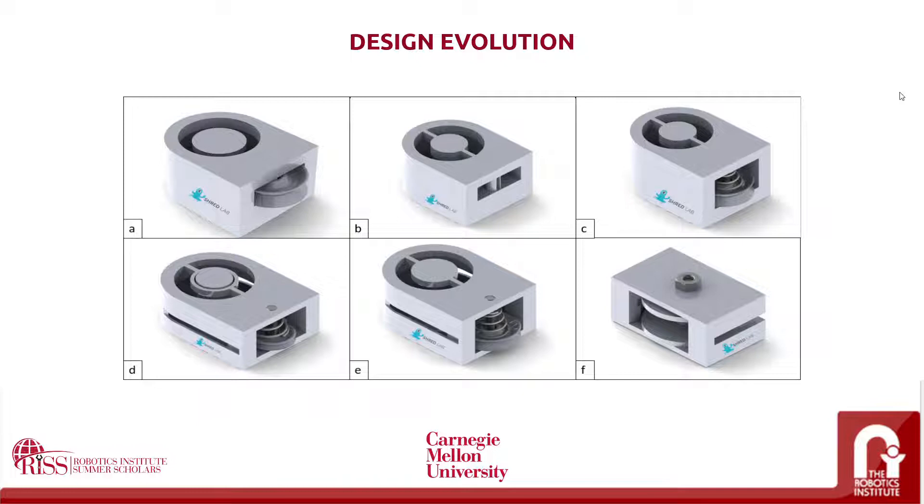The initial design was an individual disc tensioning system. However, as the prototype stages began, we found it more useful to separate the storage of each thread and its tensioning mechanism, which was considered at stages A, B, and C. As we can see in the newest prototype shown in figure F, instead of holding the disc, it only holds the bobbin, and consists of a nut, screw, the bobbin, and the case, which correspond to the storage space in stage A and allow for individual manipulation in case there is anything wrong with the thread.